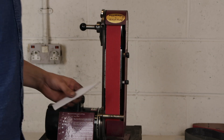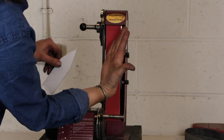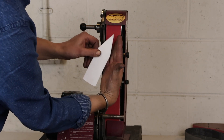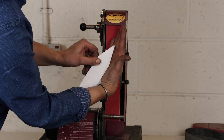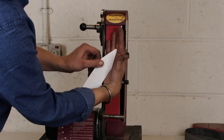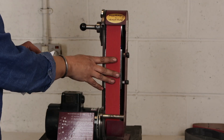The reason why that's important is that when you're grinding, if you're pushing the axe bevel against the belt — if it's got a firm backing against the platen — when you press in you can grind quite aggressively and the belt will just move past it and grind a flat bevel. If however the belt isn't backed and is floating off the platen slightly, when you press in the belt will push in slightly, bend round, and will round the bevel. If you're very unlucky it may even cut into the belt and cut through it, which is obviously something you want to avoid. So taking out this play is the most important thing to do.